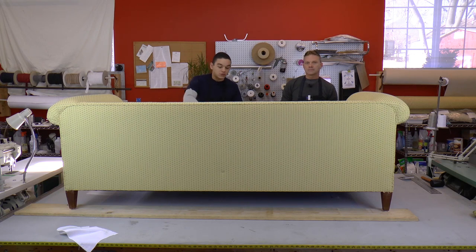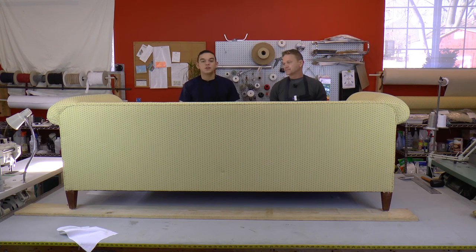That's good. You do your skirt. Once you add on the glides, those glides are about a quarter inch, so you're going to be going up a quarter inch. If you're shooting for 3/4 inch, you're hitting an inch now after you put on those glides, from the bottom of your skirt to the floor. Exactly. So just make sure you have glides that you want on there.